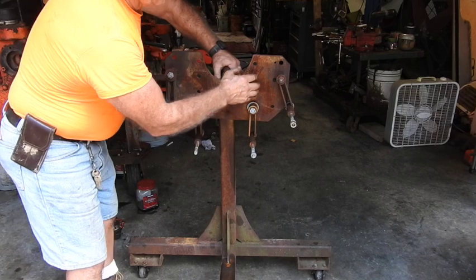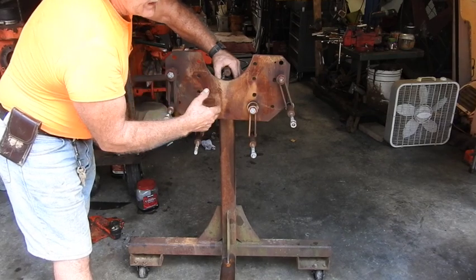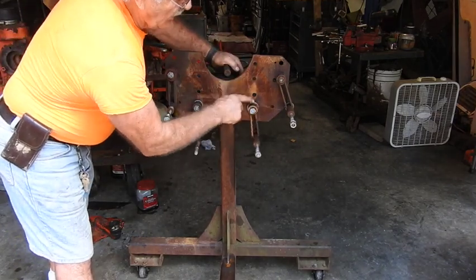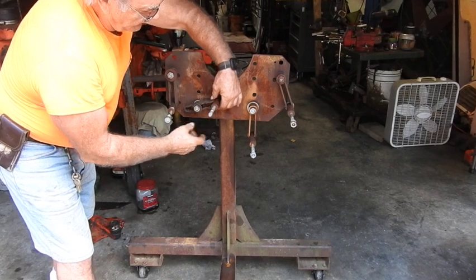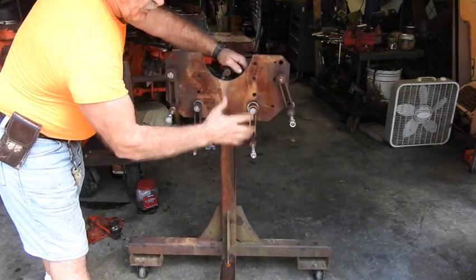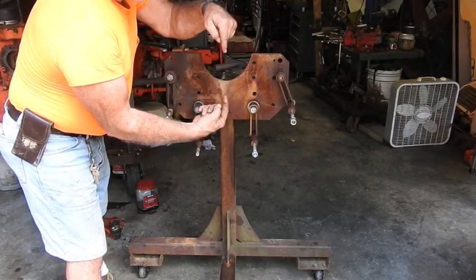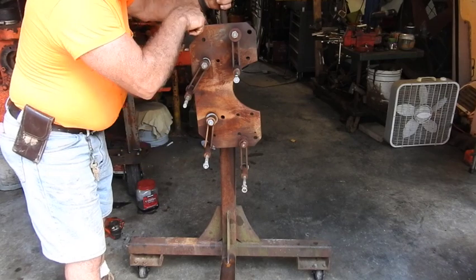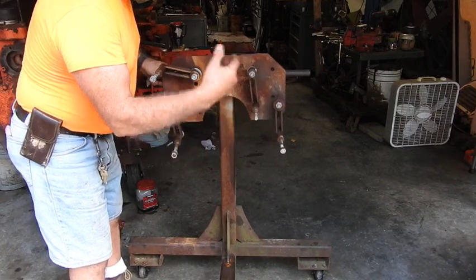I've got a 1-inch-and-a-half blower shaft all the way through this Schedule 80 black iron pipe fitting on top that acts as the collar for allowing it to rotate. Then 3/8 steel plate — all I've done was drill a series of holes, knowing you're going to be able to arbitrarily move these to fit just about any small engine in these tractors. This is nothing more than 1-inch strap that I've bent around a rod so you can slip it in or adjust for radius of the mounting bolts on the engine, whatever you need to secure the four bolts to the back of the engine housing. On this 1-inch-and-a-half shaft, I drill dimples at 9 o'clock, 6 o'clock, 3 o'clock, and 12 o'clock to allow locking into position. Like if I roll it to this point, I can work on the side of the engine, lock it in place, roll the engine upside down, lock it in place, working on the crankshaft, putting in the crank bearings, rod bearings, all that kind of stuff.